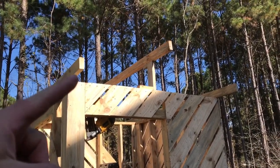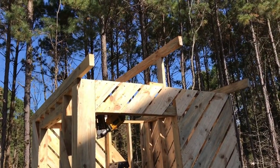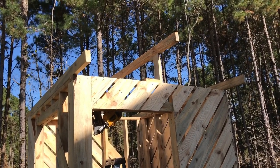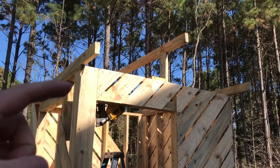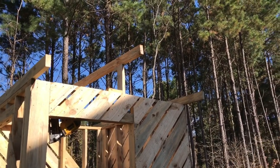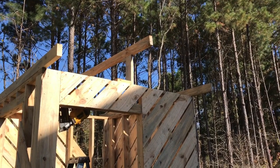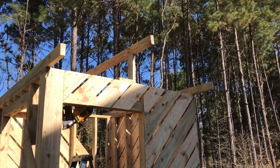On the goat barn, I put the roof on — the rafters — and then came back and added the outermost soffit or fascia board in the gable after I'd already put all the other rafters and purlins on. I had basically run the same beam down-nailed to the wall, which made squaring out the eaves really annoying. This should work a lot better because my rafters will come right down on top of this beam from the ridge, everything will be well supported, and my purlins will run out flush to the face of that outermost rafter.